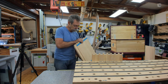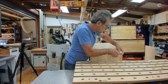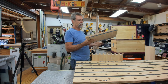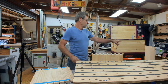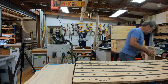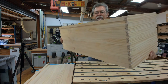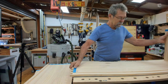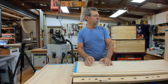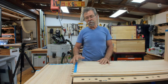Let's put this one together - I'm going to do a quick check that it fits. Look at that - it's going to go on perfect. I'm not going to put it on all the way. I'm going to put the base in and just a dab of glue there - that's going to hold everything square for me as I'm putting it all together. So base in, slide this one this way, the pins are going in this direction, and then at the end I can pull it up nice and tight and just leave it like that - it's all supported. Then I'm going to put the end on - that way I'm not having the glue sitting there for a long time.